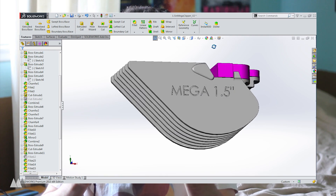While that might sound like a hassle, it's really great when, for example, I want to change a two and a half inch clipper to a one and a half inch clipper. I was able to make a completely different version of the clippers by just changing the value of this distance from the clipper itself, which is pretty cool.